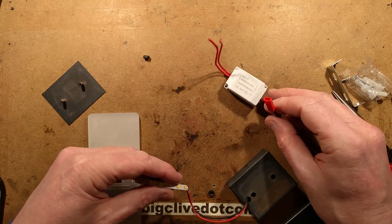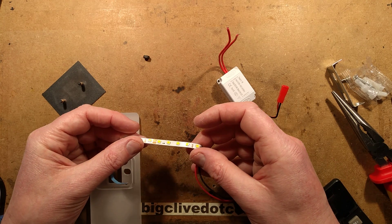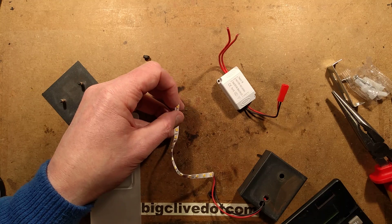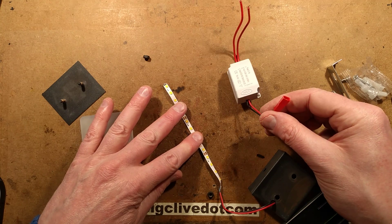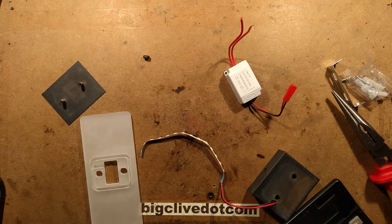It says up to 30 volts — I wonder what that is then. Or are the LEDs wired in series-parallel combinations? There's one way to find out: get the bench power supply on and dab it on to see. Or I could just plug it into the power supply, power it up, and see what voltage is across it — that would make sense as well, let's do that.